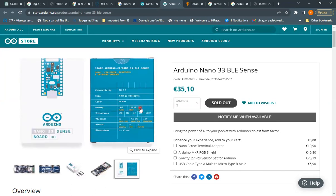Check what the RAM and flash memory of Arduino Uno were — I believe 32 kilobytes was the flash. The Nano 33 BLE Sense has interfaces including USB, SPI, I2C, I2S, and UART. It operates at 5V and 3.3V, with an input range of 4.5V to 21V. It has 14 digital pins, 6 PWM pins, 8 analog input pins, and dimensions of 18 by 45 millimeters.